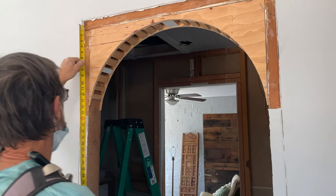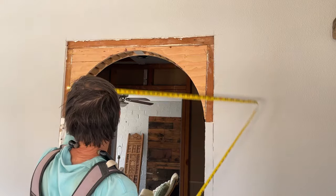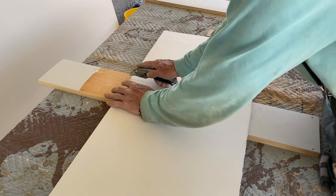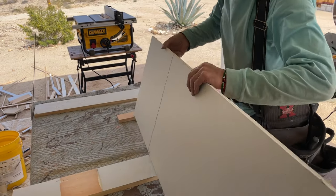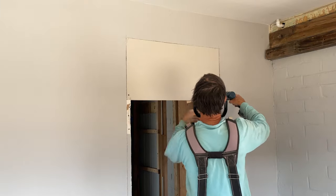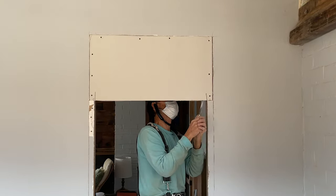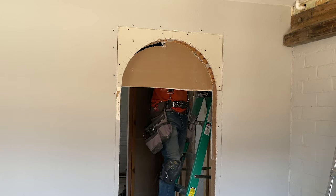The next step is to measure out your space to make the drywall arch — measure those two sides and the length. On a piece of drywall mark out that rectangle, making sure the thickness of the drywall matches what's already in your house. Using a sharp utility knife, cut a small incision into the drywall, then snap it and use the knife once more to cut the backing. With drywall screws, attach that piece of drywall to the 2x4 framing, then cut out the arch using your plywood arch as a guide with a drywall saw to get that perfect half circle. Repeat on the other side.